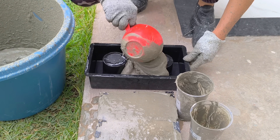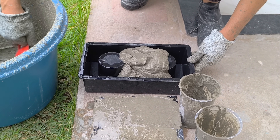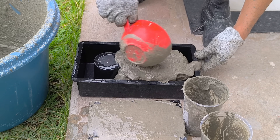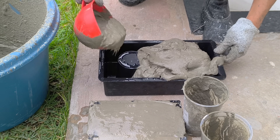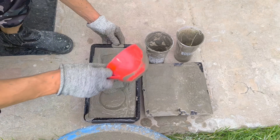The minimum curing time for demolding is at least 36 hours. The role of the plaster here is simple and strategic — to accelerate the initial setting, reducing the waiting time without compromising the structure.